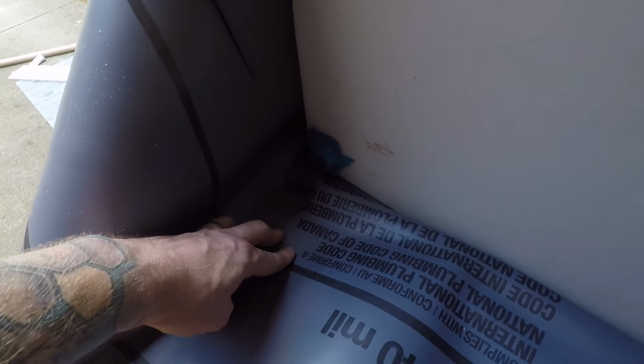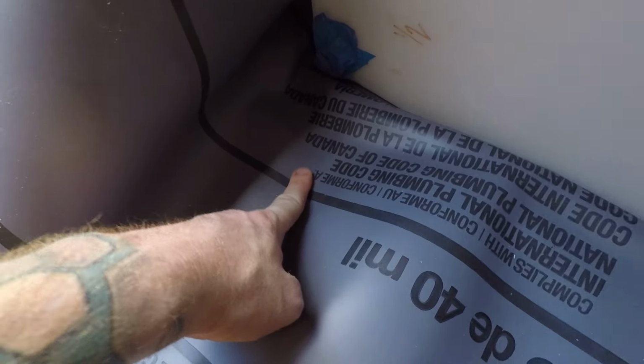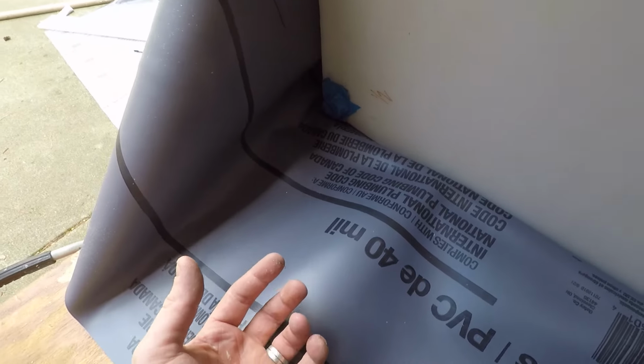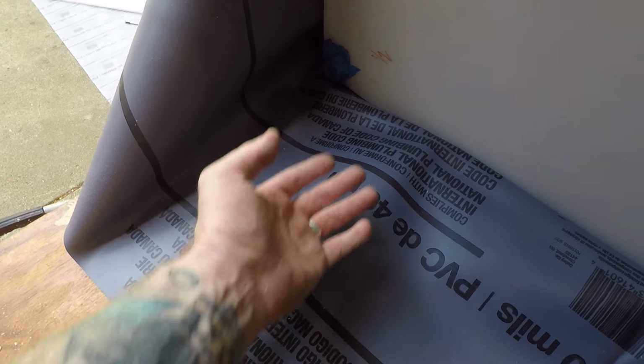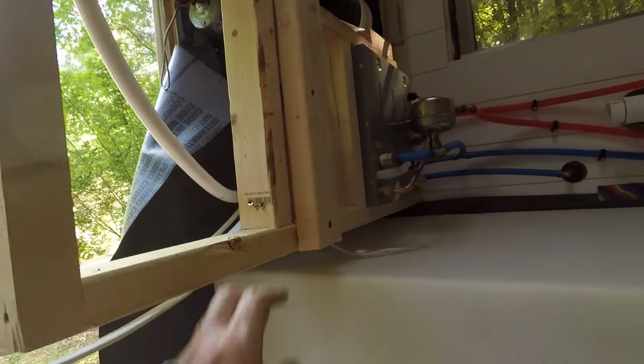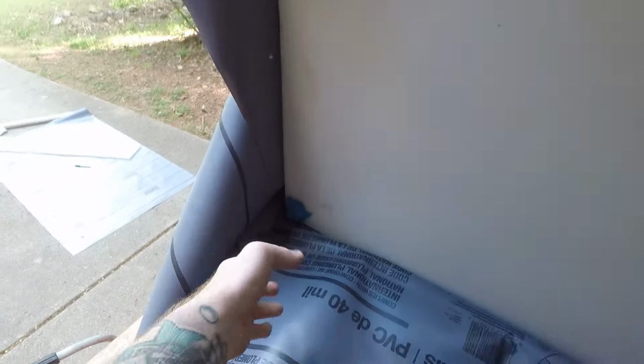And then I'm gonna work on putting a drain right here under the bus. I'll put a HEPVO valve hanging down under the bus, and that valve will open if this fills up with water. I'm also gonna put a water alarm sensor here so the alarm turns on if it detects water. So if all of this water from the whole system leaks anywhere, at least most of it should fall in here, drain out the bottom of the bus and trigger the alarm.